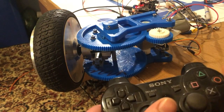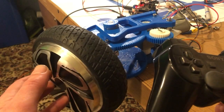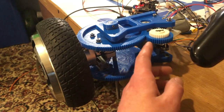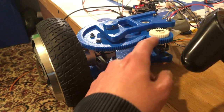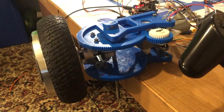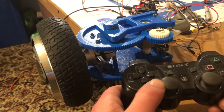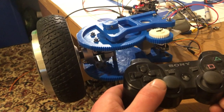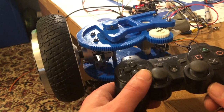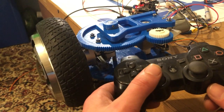You can see it works — it turns the wheel, which is exactly what it's supposed to do. The only reason we haven't got much steering angle is because the potentiometer only turns about 180 degrees and when it's geared down that much you only get a small amount of travel. But it still works — this is essentially converted into a giant powerful servo. I did have it following the position of the analog stick but it was a little jumpy as you can see. I'm sure with a bit more modification to the code we can get it smoother.